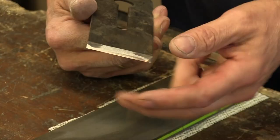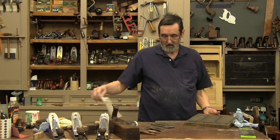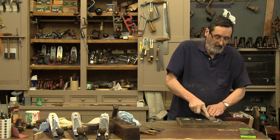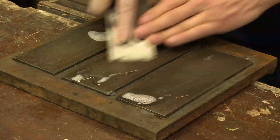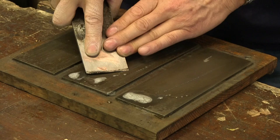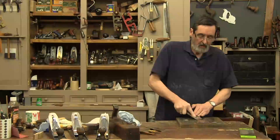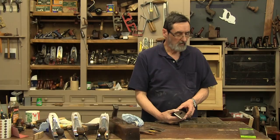I'm going to a different series of plates now. These are just a series — you could use abrasive paper if you're stuck for diamonds. I'm spraying on some window cleaner — auto glass cleaner — it works perfectly on these plates. Lifting, lifting, dropping down. This plate here is around 600 to 800 grit. You could stop there and this plane will cut — you'll be perfectly happy with the shaving you get. I'm dropping all the way to the heel rather than just doing the bevel, to make sure I'm not making the cutting edge too thick. It's starting to polish out.